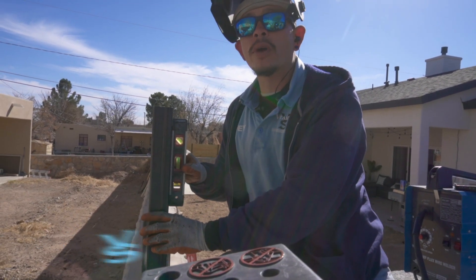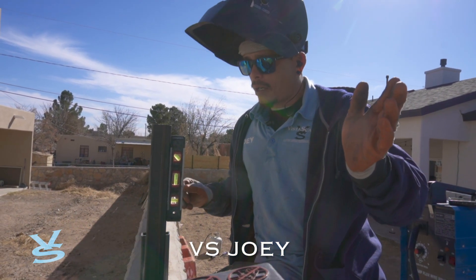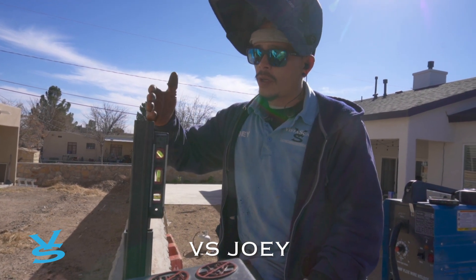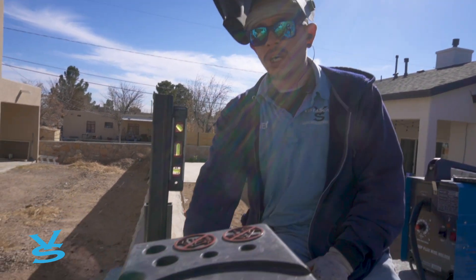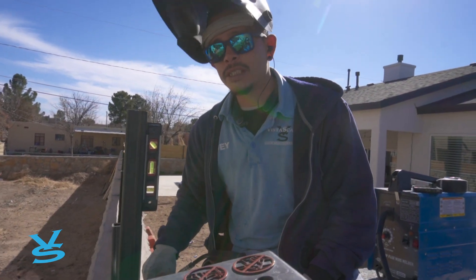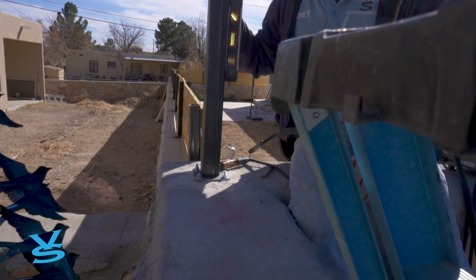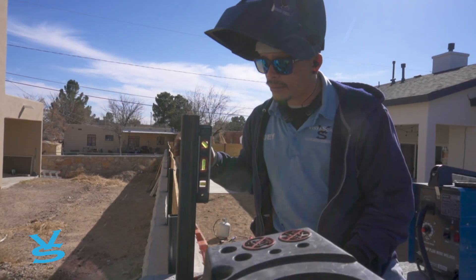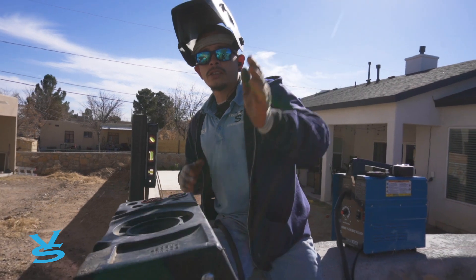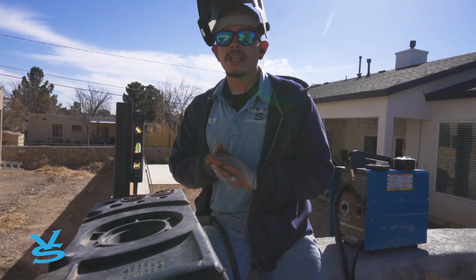On every straight wall you need two points of reference so that way you make a straight line. Vice versa, you need one on top and one on bottom. The one that we already snapped is for the plate so it could be in line, and now the top needs to be in line. With that level here, level over there, run a string line — it makes everything look good.